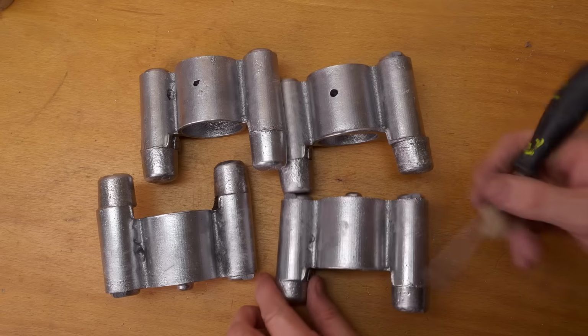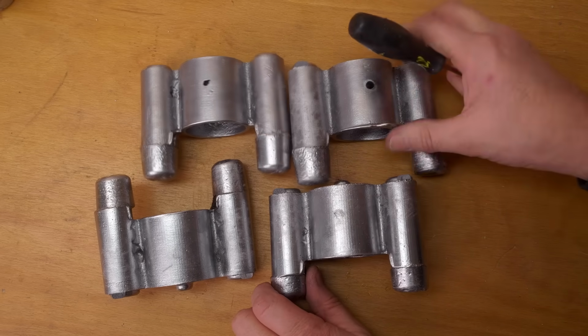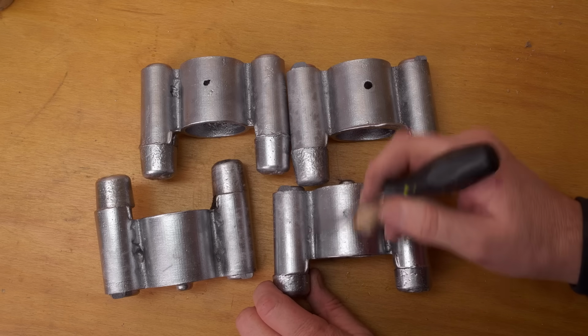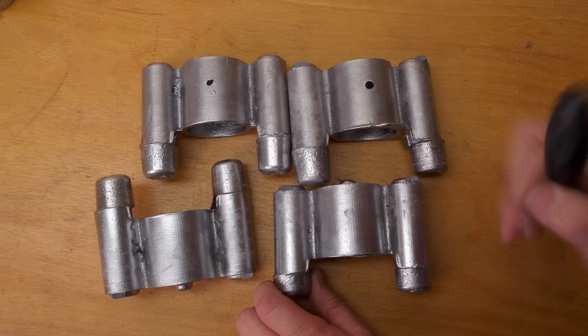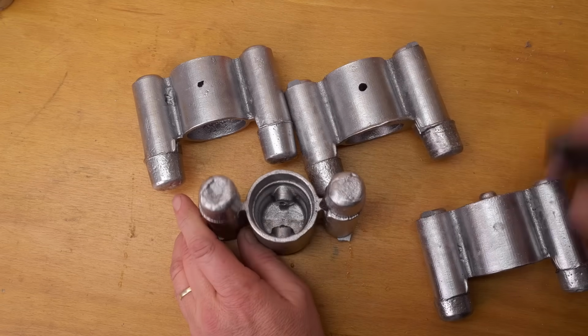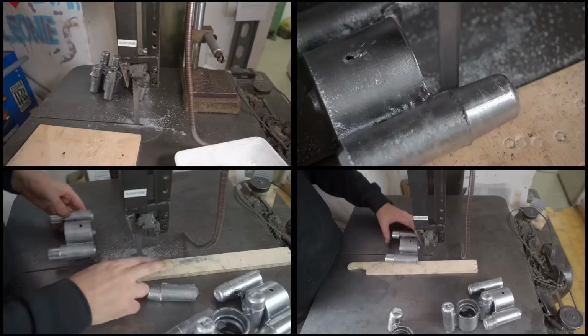Well, you can really see that high silicon alloy really likes to shrink. I made the risers bigger, the runners shorter, and reduced the machining allowance over multiple iterations of this pattern to try and get the shrinkage out of the parts. Pretty happy with the general quality of the castings. Right, let's degate these and see what they look like.